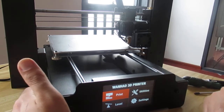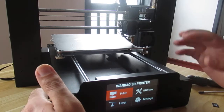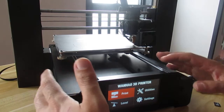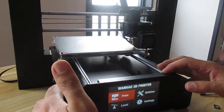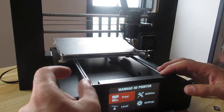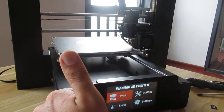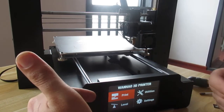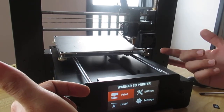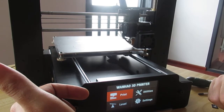So this is all I can tell you about now. And in case you have any question, you can drop an email at support@wanhao3dprinter.com. It's a new interface, new design, some new features, and as I showed you, you need to copy the file on a micro SD card, put it on the display setting board, and then it automatically upgrades the files. And after that, just remember, turn off the printer, and then turn on the printer, then it goes to upgrade. That's all for now.